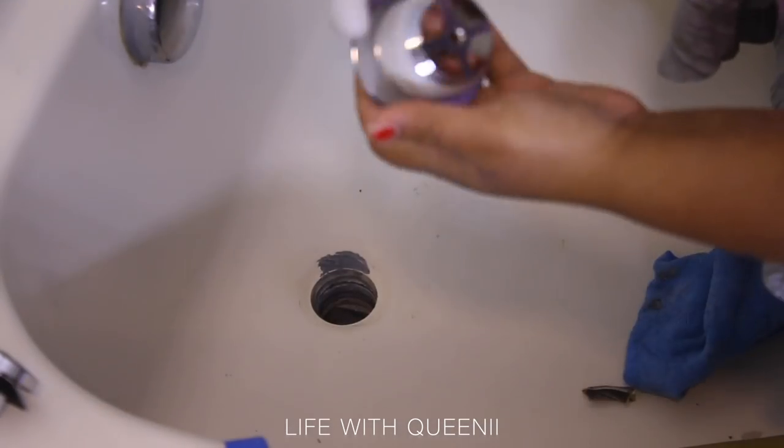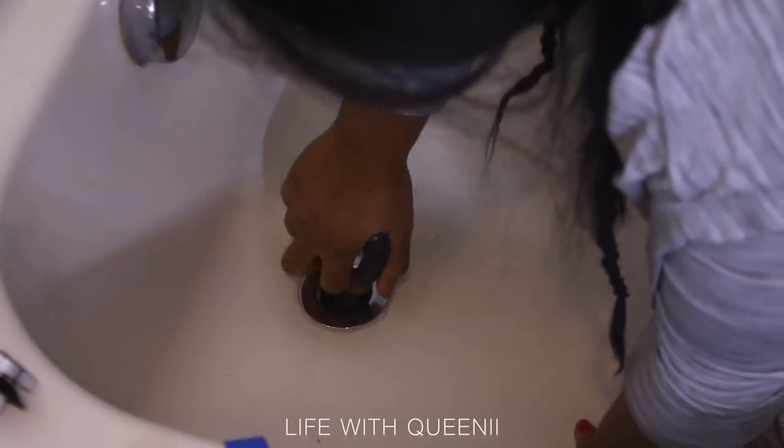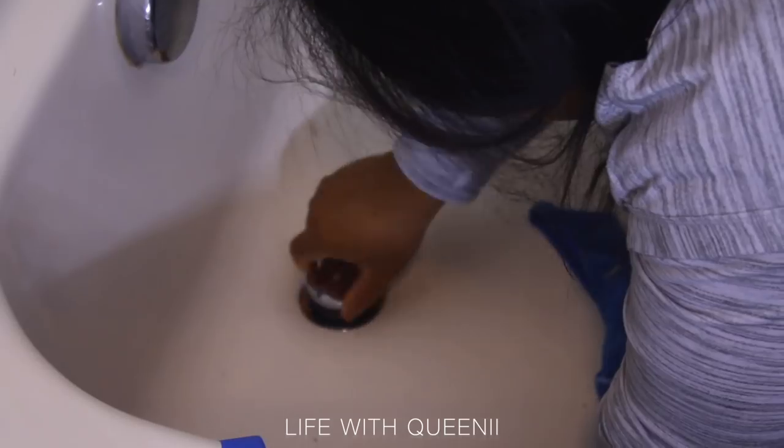I just left the rubber ring since mine didn't need replacing, and used plumber's putty around the top part of the drain, then screwed it in — whatever excess squeezes out once you screw it down. Try to make sure your drain is lined up properly so you don't mess up the threads. I'm using needle nose pliers to screw the drain back into place, then rubbing off the excess plumber's putty. I wanted the same drain but it was sold out, so I went with a traditional pull-stopper style.